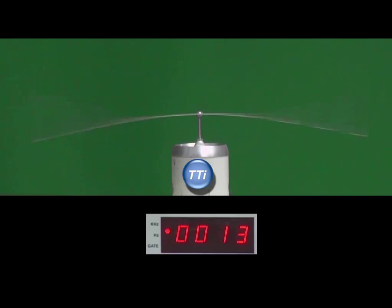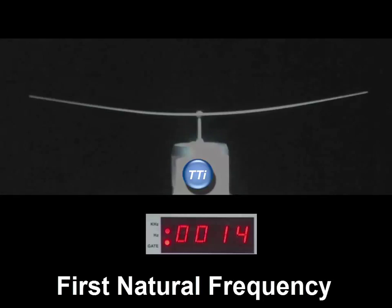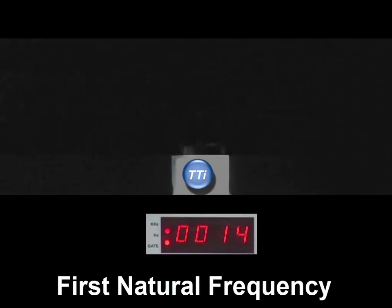This is about 13.5 to 14 hertz and we can see quite large motion. Let's try and see what that looks like with a strobe light. The beam is vibrating at about 14 hertz — its fundamental natural frequency. I have the strobe flashing at 13 hertz approximately, so we can see the beam apparently moving at 1 hertz. The mode shape shows essentially zero displacement in the middle and zero slope. Remember, we're looking at two cantilevers, one on the left and one on the right, so we expect to see the same thing on each side.